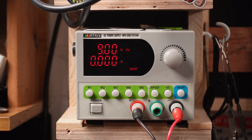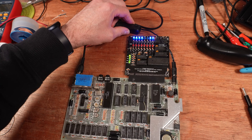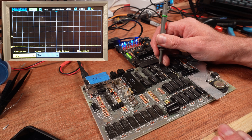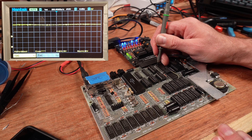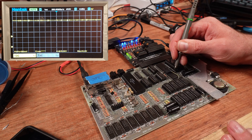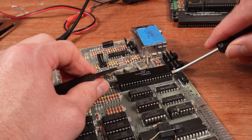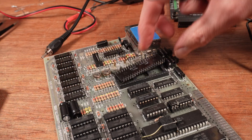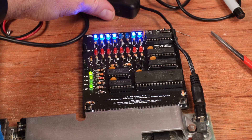The original diagnosis was dead, which is 100% accurate. Powering on with the capture running results in no display output whatsoever. Plugging in the diagnostic cartridge shows a system in great distress. Scoping around I find there is zero activity anywhere - no clocks, address and data lines are either low or high. The reset signal goes high and stays there. Could be a dead CPU or, more worryingly, a dead ULA. The CPU is soldered to the board but the ULA is always in a socket. Placing the suspect ULA into another working issue three Spectrum confirms the ULA is toast.